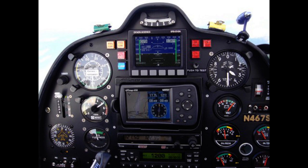5. Both ignition systems switch on. 6. Choke/enrichener on, or pump primer as appropriate. 7. Throttle closed. 8. Brakes on. 9. Ensure propeller area is cleared. Loudly announce to propeller area 'Clear prop,' and wait for any response.